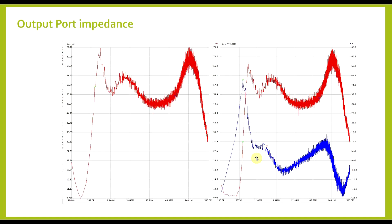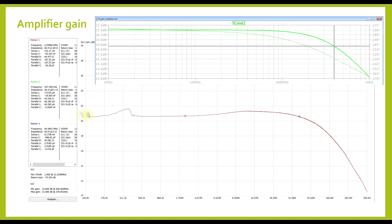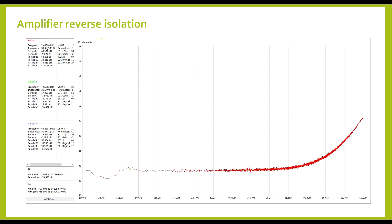Using this amplifier in a 50 ohm system should not create too much discontinuity. The gain is more or less 20 to 21 dB up to about 90 MHz, after which it slowly drops off. Even at 500 MHz — the maximum value at which I measured — we are still getting more than 10 dB of gain. Finally, I looked at the amplifier's reverse isolation: how much of the signal injected into the output makes its way to the input. The smaller this value, the more stable the amplifier will be. Here we see a value of about minus 26 to 27 dB up until about 91 MHz, after which the reverse isolation increases a bit. So all in all, this amplifier should be quite stable and provide decent results.